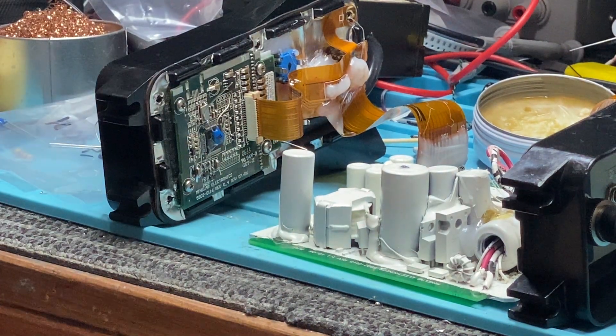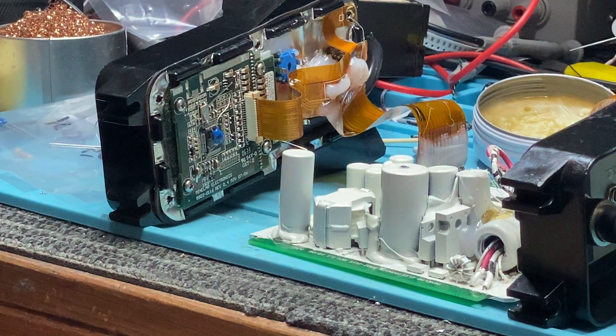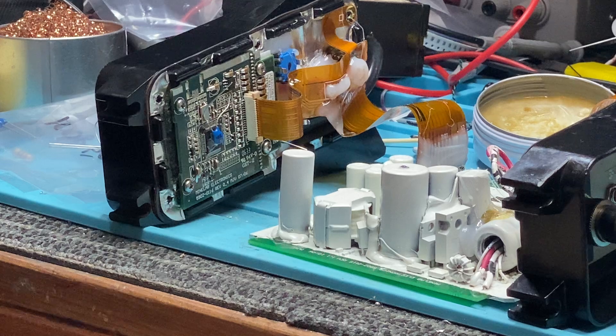The crystal oscillator would just stop working. So I looked at all the interconnection capacitors around the crystal in case something there was funny - ceramic capacitors are really fussy things. But then I found out that if I heated or cooled the board, I could make the fault appear more or less.